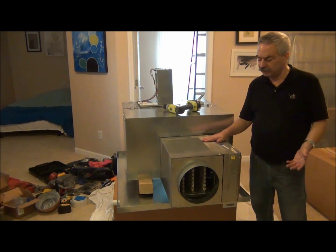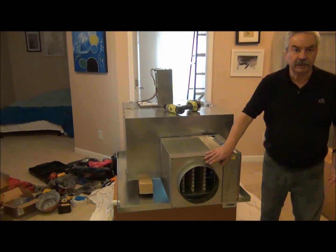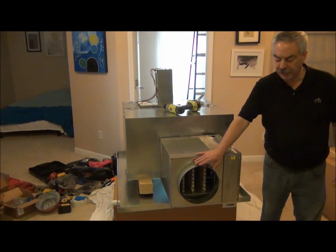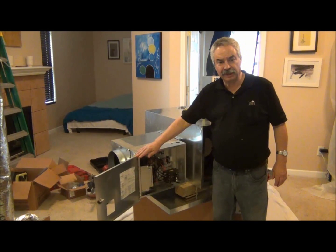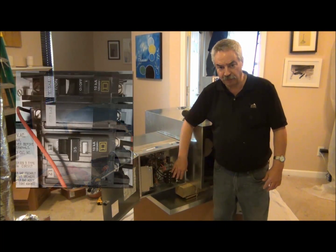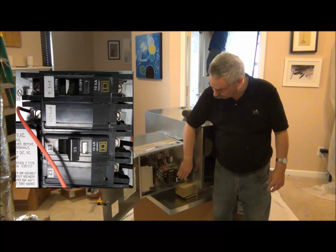So that's our electric furnace. We make this with both a round and a square adapter, depending on what kind of plenum you're using. For today's job we're going to run 9-inch single-wall 26-gauge metal pipe, so we have a round adapter. We've opened the panel for our electric furnace — this is where we run our main 240-volt power to, for our air handler, through the breaker right here.